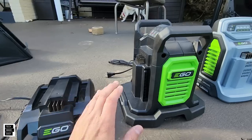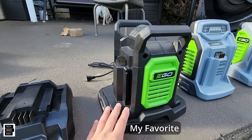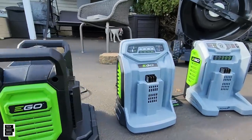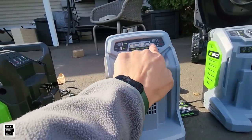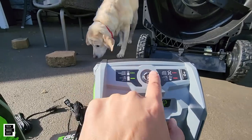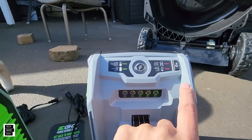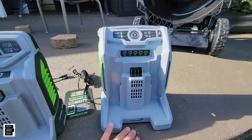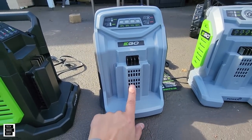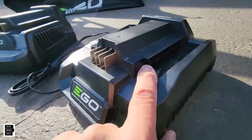And then you have an option of getting a dual charger from Ego. We'll always put links in the description, but you can charge two batteries on this. This is around 280 watts on each side. Then you've got a rapid charger, which is 550 watts. It does have a fuel gauge. Last, you have a 700 watt fast charger. This has the same fuel gauge that you'd have on a battery. You can connect this to the app, so you can get notifications that your battery is 75% charged, etc. As you can see, most of them come with fans to keep the battery cool, especially towards the end of charging. They blow the air on the battery. So there you go.